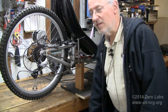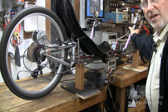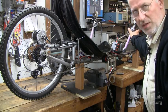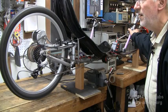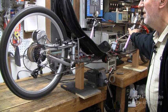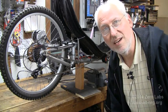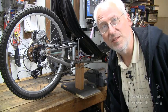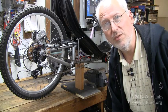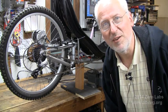Here it is at slow speed — that's the three batteries in parallel for 12 volts. And here is high speed — the three batteries in series. Incidentally, the back tire is spinning at 807 RPM with no load, which equates to 54 to 56.4 miles per hour under a no-load condition. Under a load condition I'm still estimating 49 miles per hour. Be afraid, Russ. Be very, very afraid.